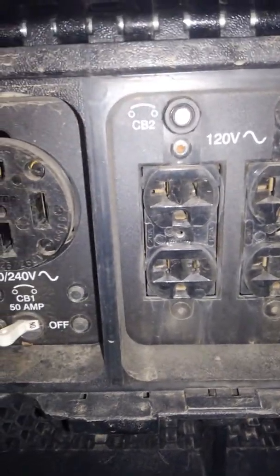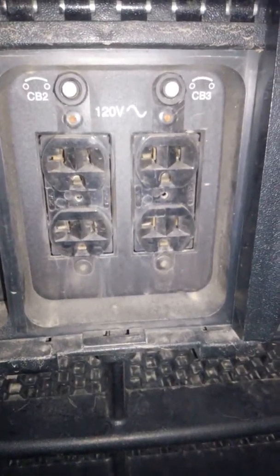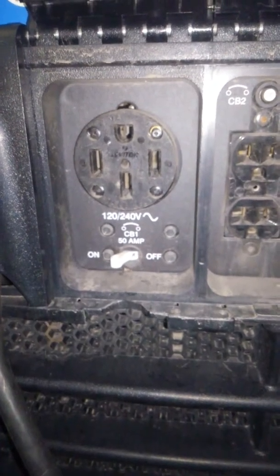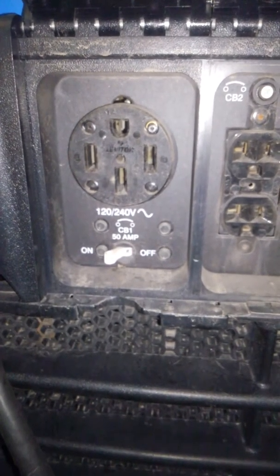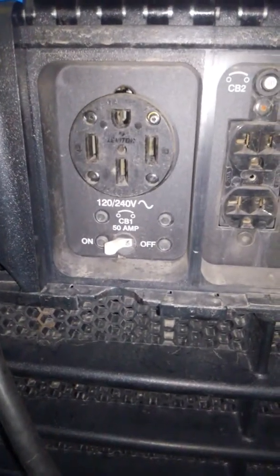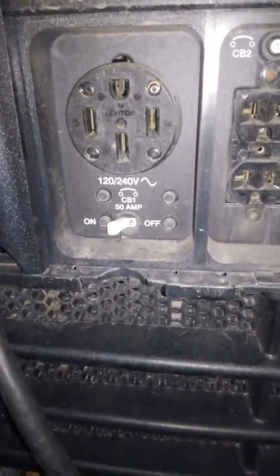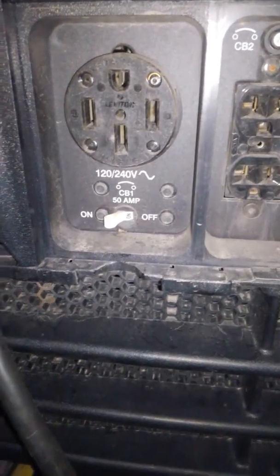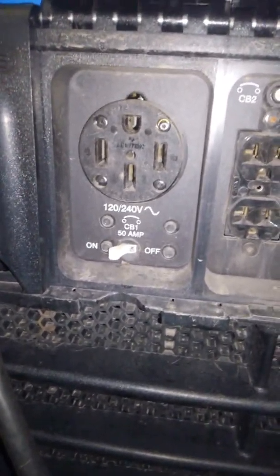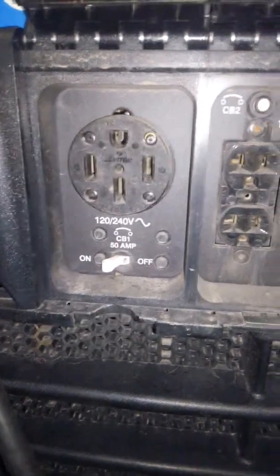As far as your wire feeders and anything you're drawing more power on — you'll kill those 20-amp breakers in a few months pulling off of them. Just get a 220 cord, split it in the back. You actually don't even have to have 220 on one side and 110 on the other — you can just go 110 on each side and have four 110 outlets back there. Either way, rather than pulling on that 20-amp breaker, now you're pulling on a 50-amp breaker. I've never once tripped the 50-amp breaker on anything I've been running portable.